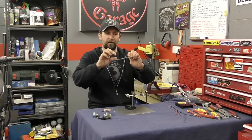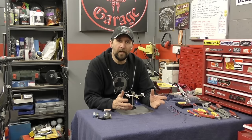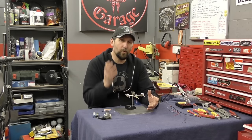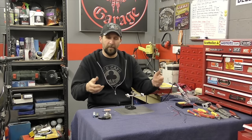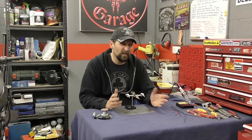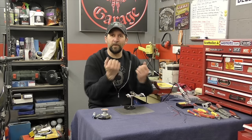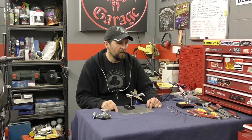Soldering. Everybody wants to know how to solder two bits of wire together with a nice, safe, secure joint properly. Now, obviously there is an element of skill to soldering. You have to develop some skill. You don't have to be clever, you don't have to be talented like a guitarist or a pianist — you just have to practice, because there are some dos and some don'ts. So what I'm going to do with this Simple Skills video is show you the don'ts so you don't get it wrong. Because if you just attack soldering straight blind, never done it before — this is the solder wire, this is the soldering iron, you melt that on there and it's done — no, it isn't. The weld will fall apart. You'll have what's known as a cold weld. There is a certain technique that must be carried out. And if you get it wrong, you're never going to make a decent soldered joint. No matter how many times you try, you'll just be confused why it doesn't work. Then it gets frustrating, then you get bored with it, and then you end up with a squeeze joint instead because it's easier. So let's show you how to do some basic soldering in a simple way with a few dos and don'ts to help you get practicing and start building this skill for yourself.